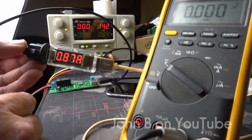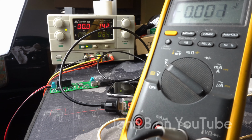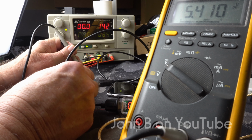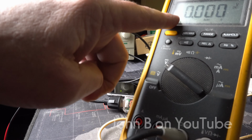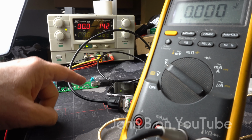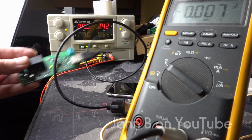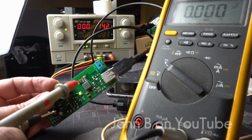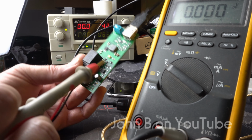Unless it's this device, I'm not sure. But you can see, with this device connected, this charge port comes up to 5.3, was it? Forgetting, I tested it so many times. Oh, 5.4 now, look. 5.41 volts, which exceeds the USB 2 specification. Shouldn't exceed 5.25. But boosting the voltage compensates for voltage drop in the USB cables. So that's how the cable compensation works on a Texas Instruments TPS2511, and then that's the buck regulator I showed you earlier, the Wurth coil, 3.3 microhenry coil, split charge relay.